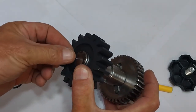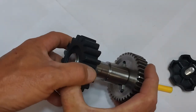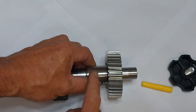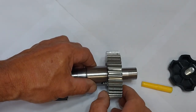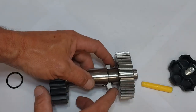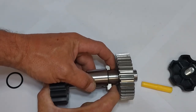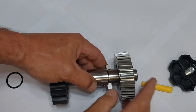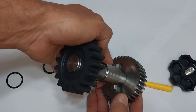On the other side, a steel clip and washer is fitted to minimise play on the pinion gear. On the main drive shaft, we have the clutch system. This pin is basically a square pin, which is locked in place via a steel pin that is constantly under spring tension. And this steel pin locks into the main drive gear.